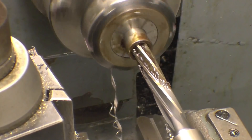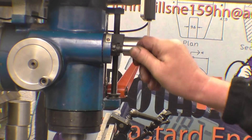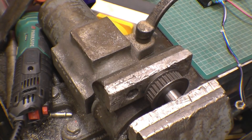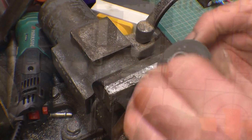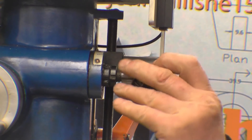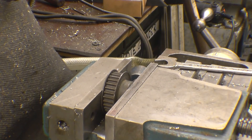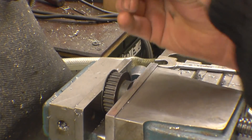Do all the 12mm, which will fit the shaft quite nicely. That's a lovely fit on there. Put a couple of M5 grub screws into here — just put your holes in and ignore the original one.